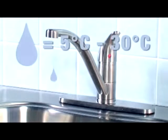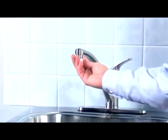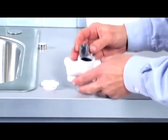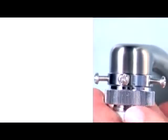Be sure you're installing the eSpring water purifier onto a faucet that supplies cold water. Do not run hot water through the water purifier at any time. If your faucet has an aerator or wire screen, unscrew to remove it and the washer from the end of your sink tap. Then unscrew the plastic ring and metal connector from the top of the diverter, and set aside the plastic ring and diverter. There are four possible ways to complete installation of the diverter, depending on the shape of your tap. We'll go through all four here to make sure you're covered.